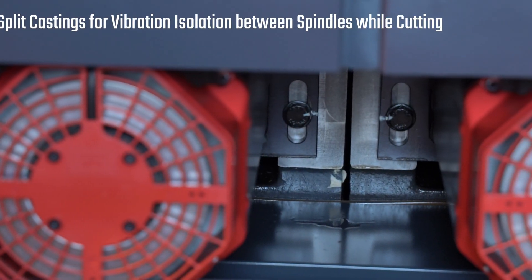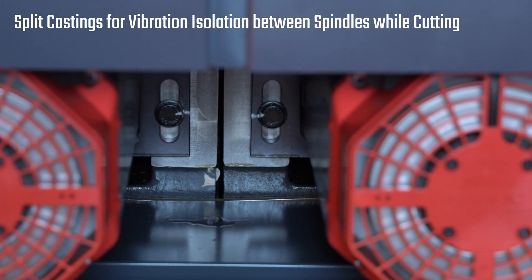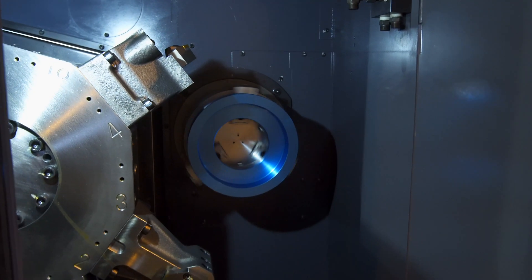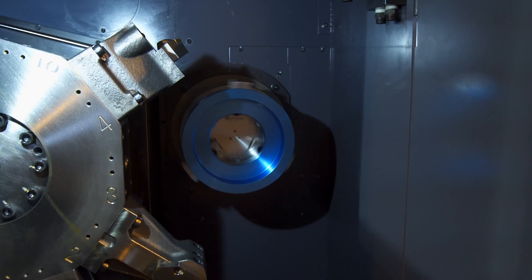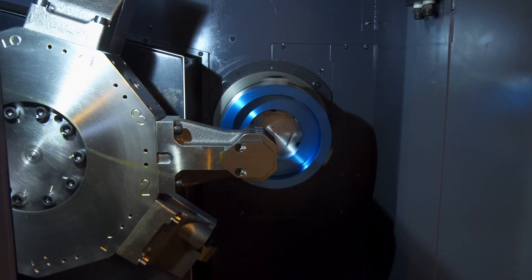With high rigidity, this optimized bed design is good for heavy cutting, with maximum grooving up to 14mm. Obviously, the type of material cutting is a factor. Our turrets on this machine, both stations, have a curvic coupling, which really enhances the rigidity and support of this heavy cutting.